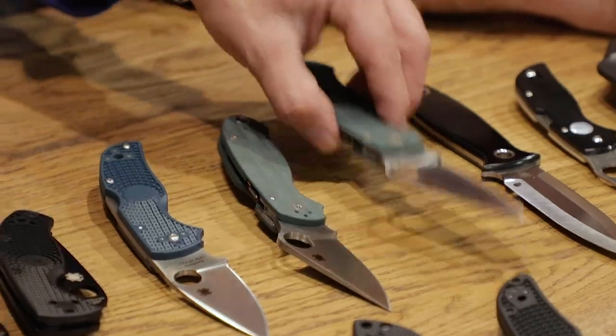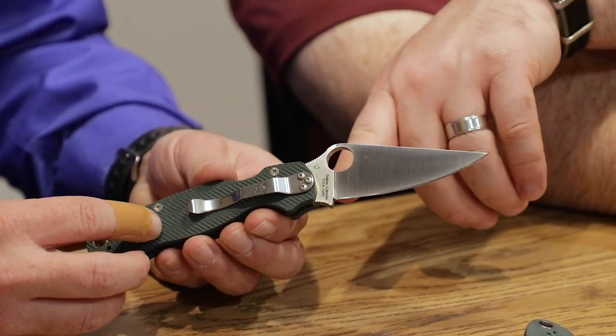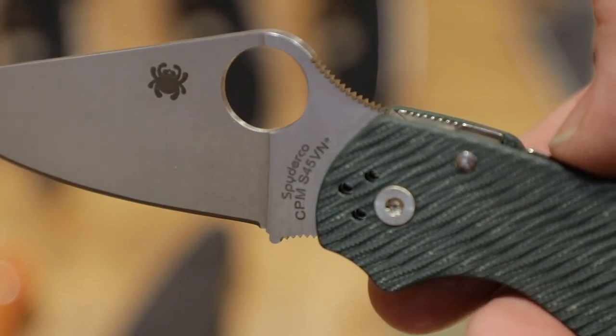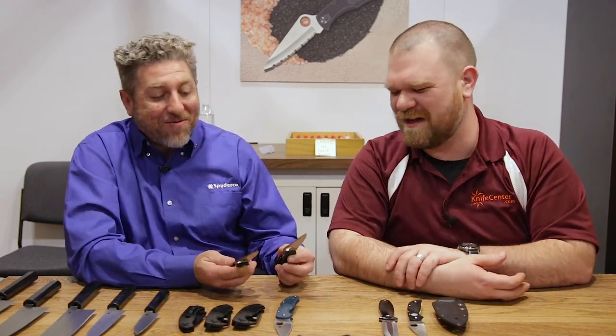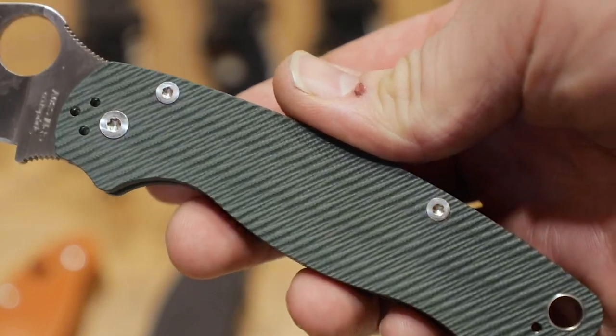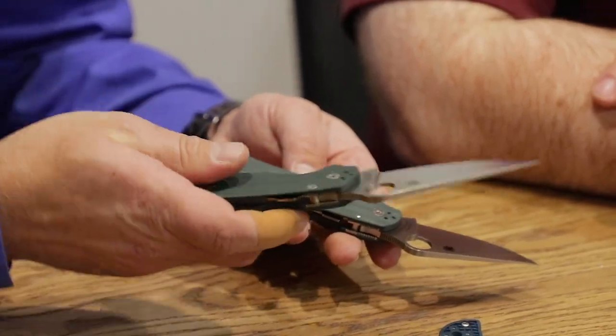The next one is also an exciting steel evolution — this is CPM 45VN. Crucible debuted it in October. We got tests through right away. These show prototypes are mislabeled as S30V, but in production it will be CPM 45VN. This is what it'll look like in production — you're going to get a green G10 with this added diamond arc texture. It feels really good, not too deep — something a little different. It grabs the thumb in any direction, which is what you're looking for, and it doesn't rip up the pocket.